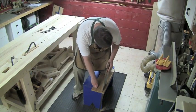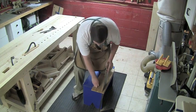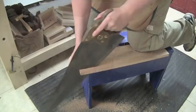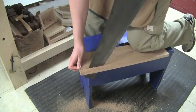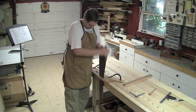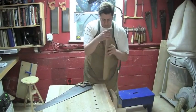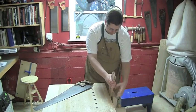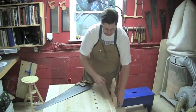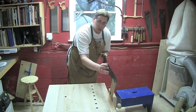The other thing to keep in mind is that we have a straight line from shoulder all the way down to your hand to your saw pull, and that will allow you to keep the saw cutting straight. You can saw standing up — it's actually quite comfortable to do it this way. You'll want to flip the board around and work the opposite face. This keeps your cut on the line all the way across the board.